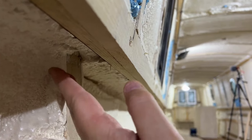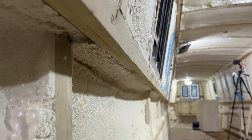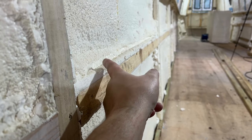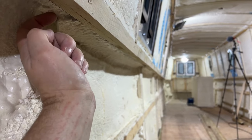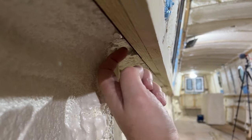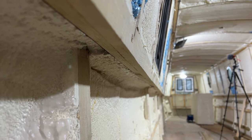So that's what we're going to do. If you look under the gunwales, we've got some battens. If we put a shelf here, then we can drill a hole through there and the DC cables can go up there. But if we put the AC run along here, which is my intention, and you run it up, you're still running cables over your DC cable, so we have to run it through the back. But I can see there's a big bit of steel there, so I'm not going to drill through that.